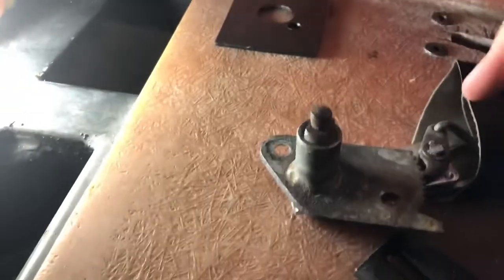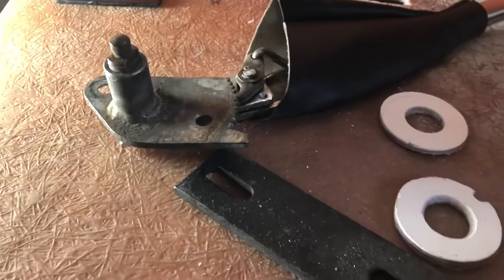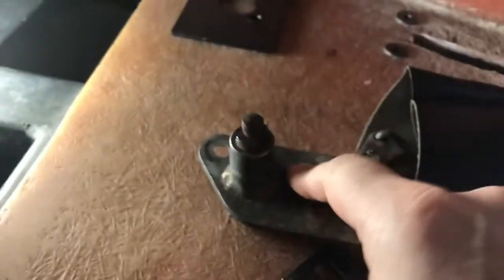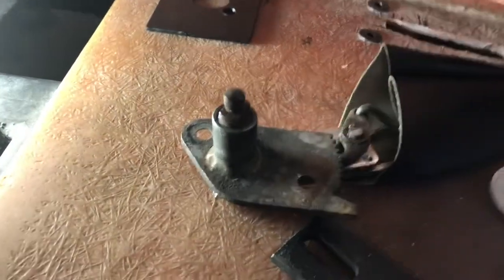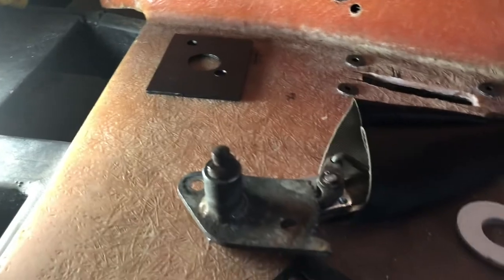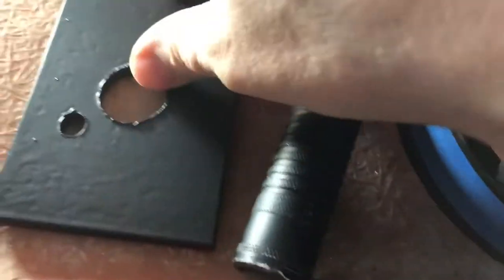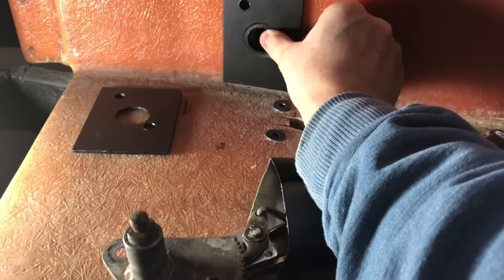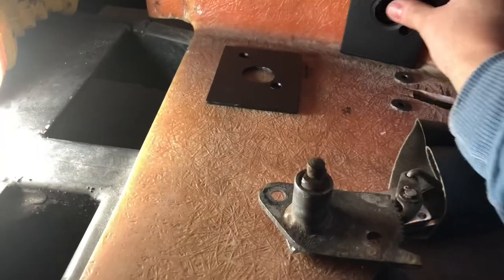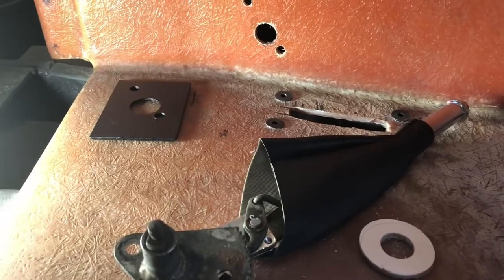As soon as I mounted this up, I realized I need a spacer because the mechanism is dragging on the wall. The gap is seven-eighths of an inch — stacking washers would create an air gap, which is no good. So I just made another plate, this one a quarter-inch thick, to act as a spacer. I primed and painted both so they don't rust. This will mount thusly, giving room for the mechanism to work.